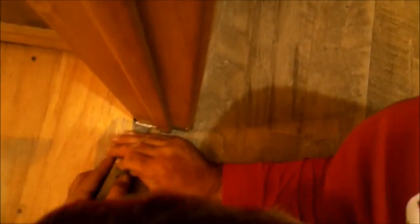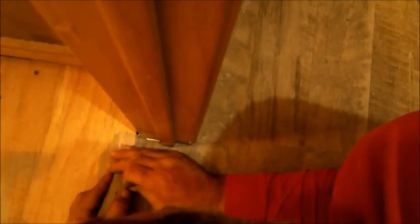Now, just so you know, what was this kind of saw you use? Multi-tool. Multi-tool? Yeah. Cut the jambs up, right? Yep. Same as you do for tile. Same things you do for tile, right? Or anything else. See, this is the jamb right here. And what he had to do is get it up off the floor, so you had some room to tuck it under that. So you take your jamb saw or multi-tool, whatever you happen to have, and go the thickness of whatever you're going to have down here and cut above that so you can tuck this under.